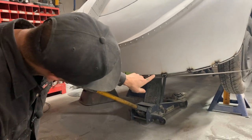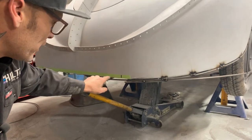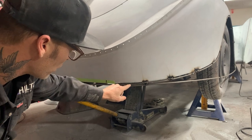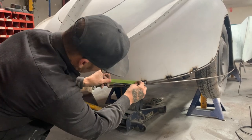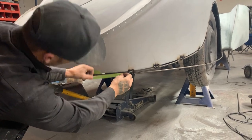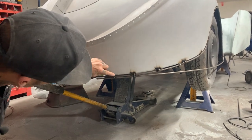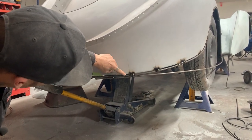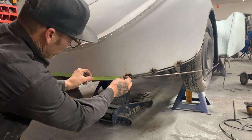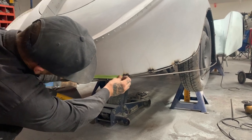As I come over here, I get the round rod here, I have a chance to build this down. This is straight along here. I have a chance to build this down so it's straight with this, build this up straight all the way along, and then I can cut the fender skirt off and we'll meet it straight. So we'll build this down, weld round on this part, and build this up so it comes down, and we can cut this off. I think we're going to about here somewhere, about there somewhere. We're going to make that straight.